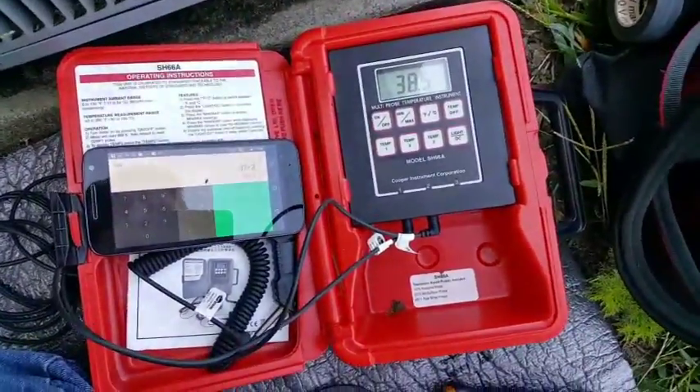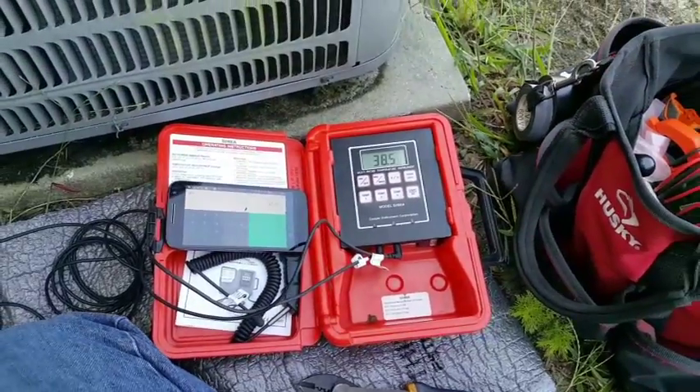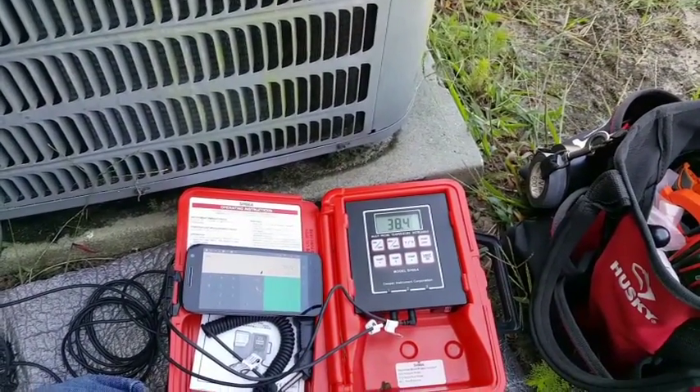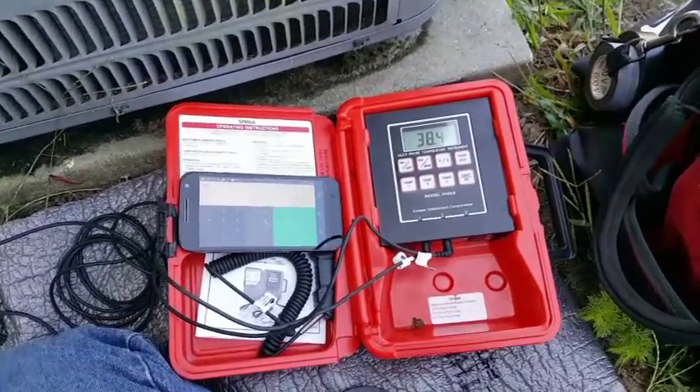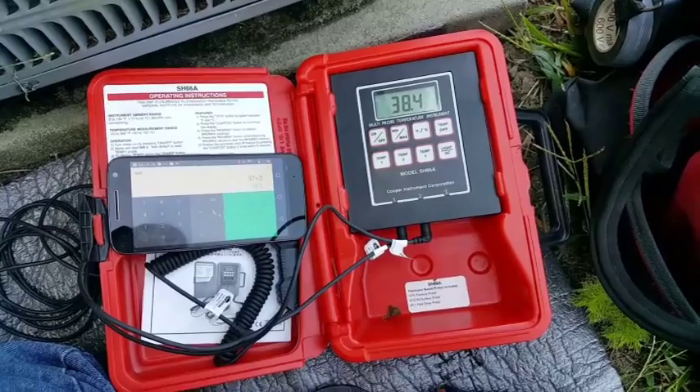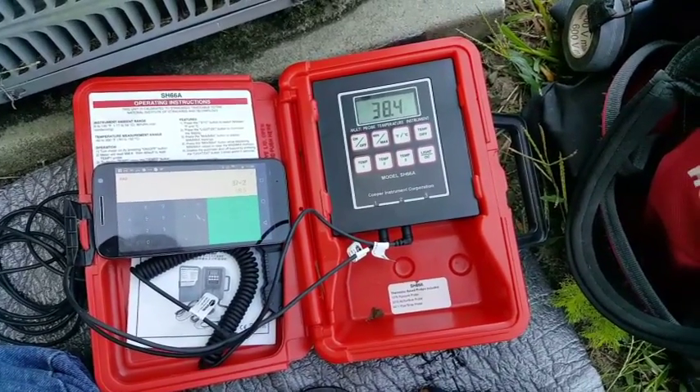So that's where we're at. The temperature split was in the 20s, but the target temperature split would be below 20 — near 17 or 18 degrees, maybe even a little bit less than that. That was a rough estimate based on the humidity inside and the wet bulb, but we're definitely going to have a low airflow situation here.